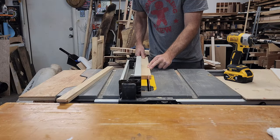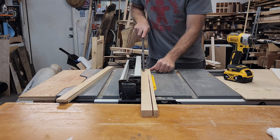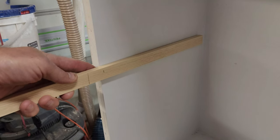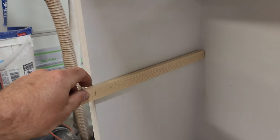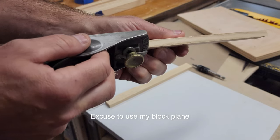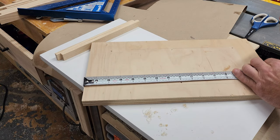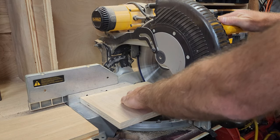I contemplated a few ways of supporting the shelf — either using shelf pins or dominoes — but I just kept it simple. I made shelf brackets and screwed them into the side of the box. Instead of bringing the shelf support bracket out all the way, I cut the piece in half to not waste any wood. The supports are gonna be hidden but they don't need those little edges, so those came off. To make sure each support bracket was at the same height, I used a piece of scrap cut to the height I wanted so I could just use that to rest and pop it on both sides.